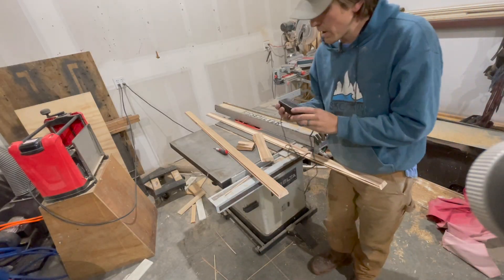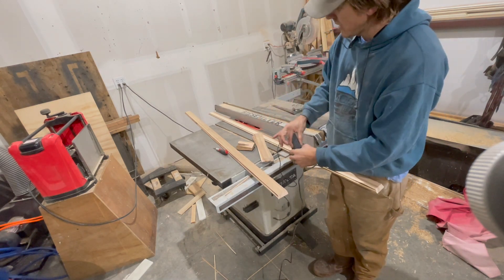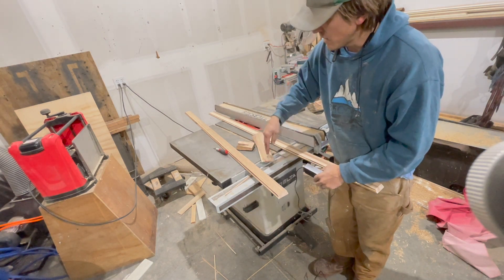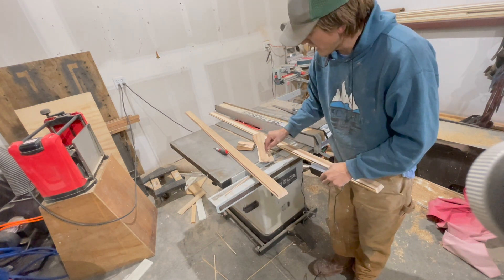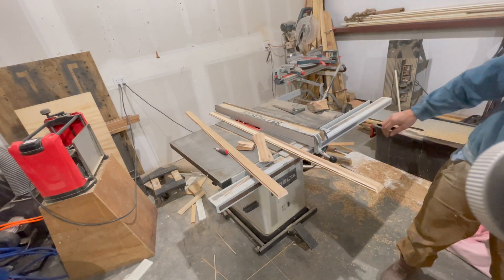So this is the power cord for that LED light strip and this is an inch and a quarter wide. So I'm going to make this an inch and a half space between where the plywood is going to sit and where the metal is going to go in the front. Measuring that, it needs to be a quarter inch from the front into a quarter inch deep as well — so that's what the metal fits in.